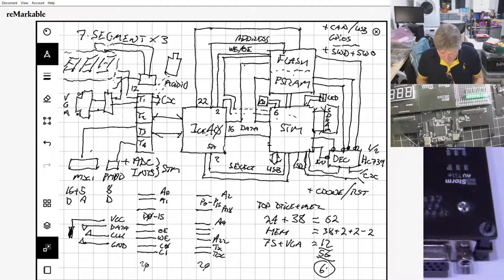I did toy with the idea of making it optional. But there's just no room to put another board connector. And you can't really take it up the mezzanine because there's just not room, because it's narrow. The maximum number of pins that you can take up each side is 20, which gives you 40 total. And we need 38 for the data, for the memory, etc. Plus you need ground and 3.3 volts. So you can't do it, even though you could. In fact, a TSOP 54 doesn't actually fit on the mezzanine anyhow. Just too wide.